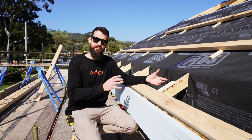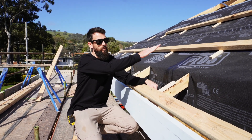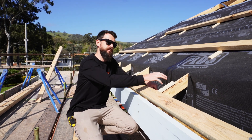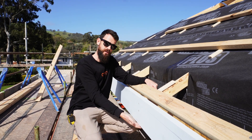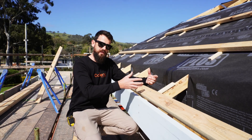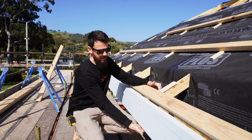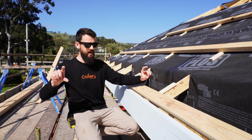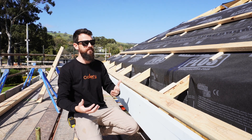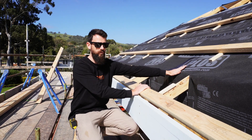You do need to be careful about how you get ventilation into these areas. The idea of running the roof wrap all the way down to the wall wrap to get ventilation into these areas — this isn't a traditional boxed eave. What we've got to match the original character of this home is actually a ventilated eave just with timber battens underneath it. So underneath the bottom of the fascias here, we've still boxed it out with a couple of pieces of timber, but by only having the timber battens under there, that'll still allow plenty of ventilation to get that stack effect all the way up into this void here.